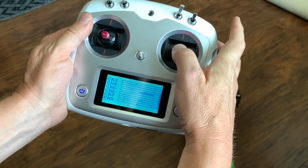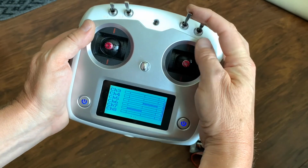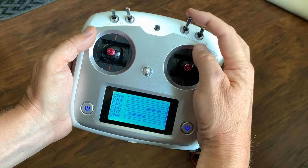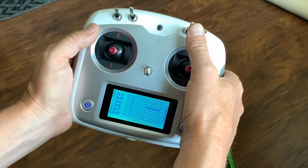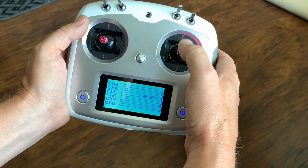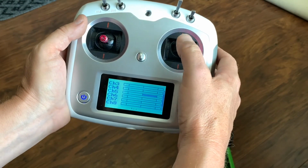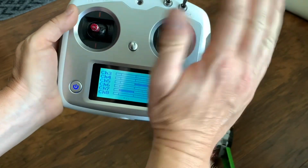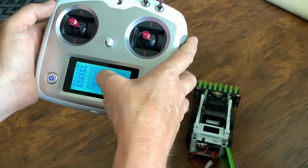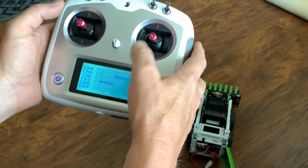So now with this on though, it's going to give me 100% pump. So this does have 2 speeds on the pump. So there's our first low speed pump, high speed pump. So if I'm in low speed pump, it's going to give me high speed pump when I'm running my boom. As long as I'm off, it'll just give me my low speed pump, which is fantastic. That will work great. All right, so that one works.